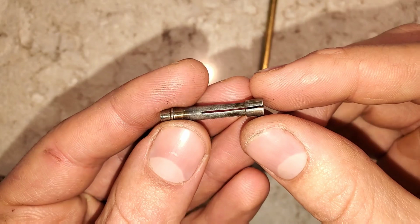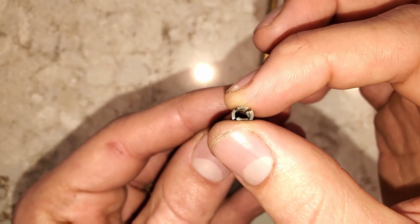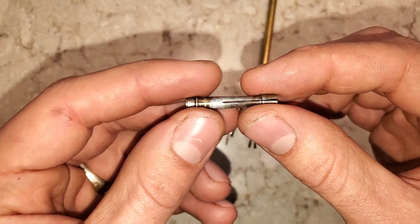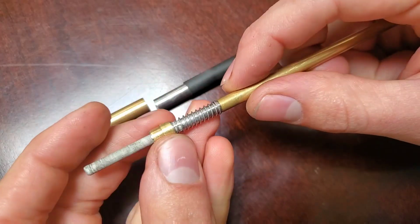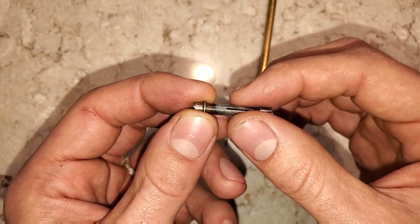This is my most successful clutch. It has long, thin grooves. It doesn't take very much pressure to push these inwards. That's important because the less pressure this takes, the lighter this spring can be. If it's a heavy spring, when you press to advance the eraser, it's not very pleasant to use. So that feels better when it's a light spring.